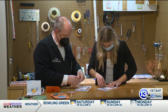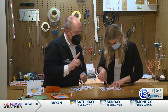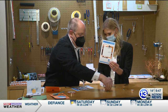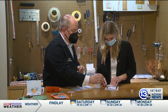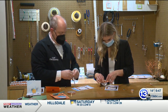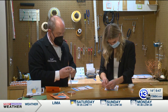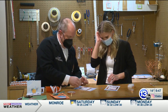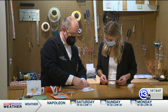The circuit has to go from the battery, through a device like the LED, and then back to the battery. When you get to the point where it has the little wires, go ahead and lay some tape on top, but leave a gap because we need the blue LED to allow the current to flow through it. I'm going to prep your LED and split it. Complete your circuit, but stop just before you get to the battery. We've got to be careful that we don't create a short circuit — carefully bridge just to the top of the battery. If we touch the bottom of the battery, we'll create a short circuit and that won't work so well.